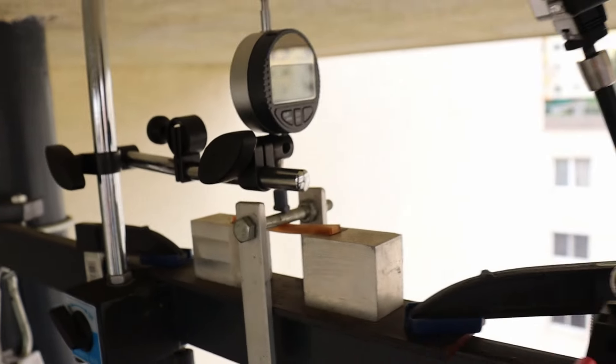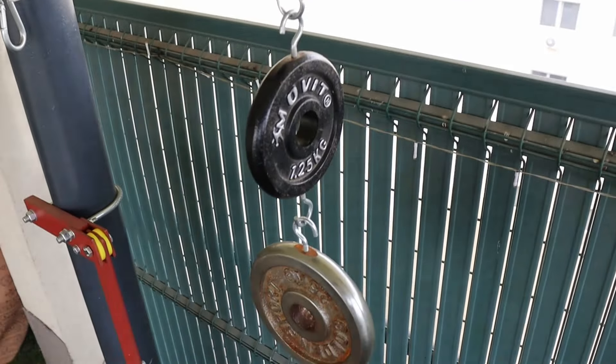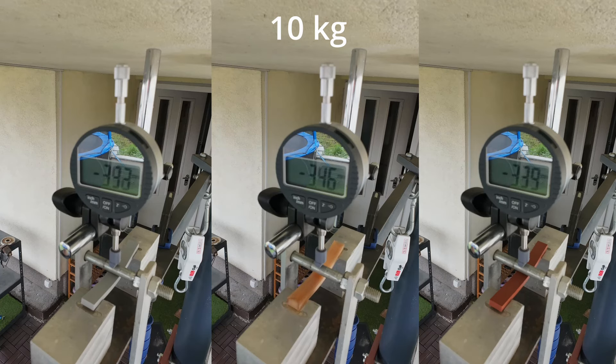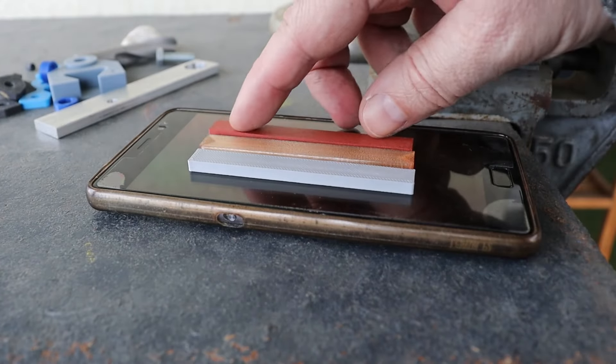The 3-point bending test — I will measure the deformation after 1, 30, and 60 seconds under these loads. Side by side all three test objects are shown. This is a speedup video. Current weight is 2.5 kg, then 5 kg, and now 10 kg. After I remove the load I cannot see any permanent deformation on these test objects — they look quite straight.